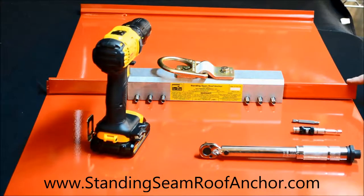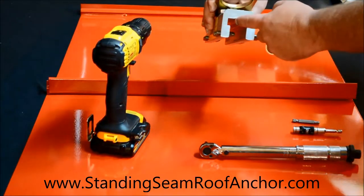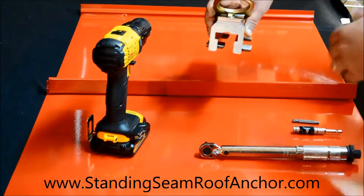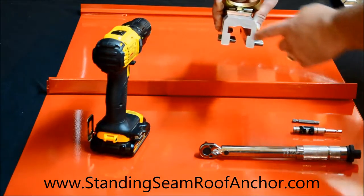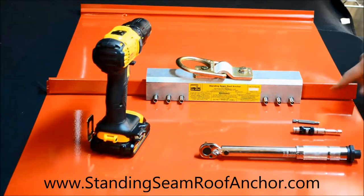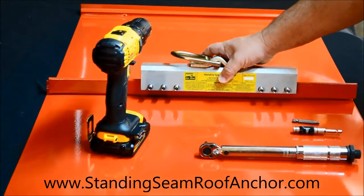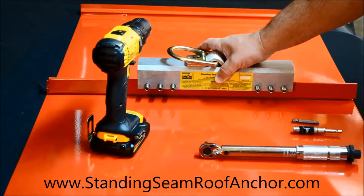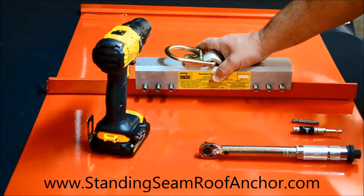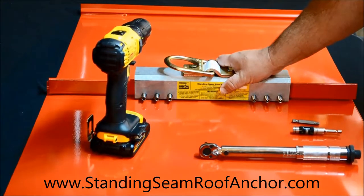So one thing to note, we are using an inch and a half tall seam. The anchor is, you have an inch and a half of height plus 1 inch of width. So, like I said, this seam's only a quarter inch. So I'll show you a little trick we use to speed up installation. But on seams that are inch and a half or shorter, the installation is very simple because the clamp itself is going to sit flat down on the panel. So you don't have to worry during installation on taller seams when the clamp is up off of the panel. You have to be careful that you don't get it tilted to one side during installation. You have to hold it nice and straight. So on inch and a half or shorter, it's very simple because it does sit pretty much flat down on the panel.